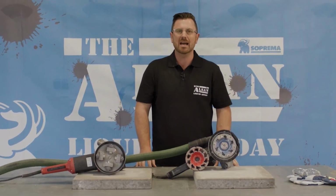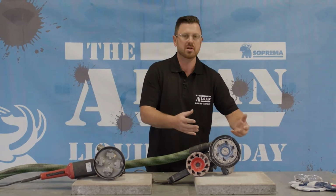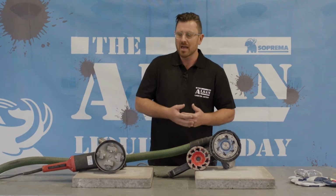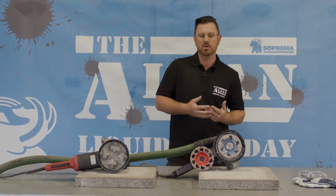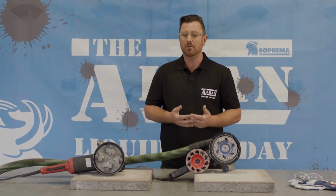You generally know one, and that's ordinary grinding, where something is simply removed from the substrate. For example, adhesion-reducing substances such as concrete slurries. In comparison, the bush hammering is a bit more intense. That means the substrate gets destroyed. The pores are significantly better opened to achieve simply one thing, the ideal key.